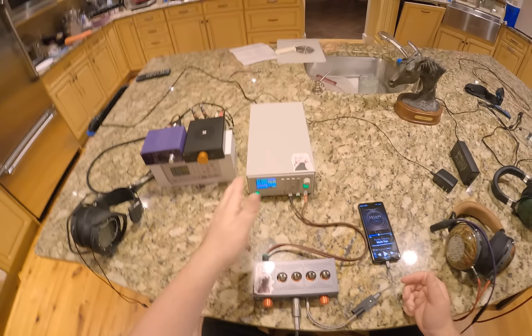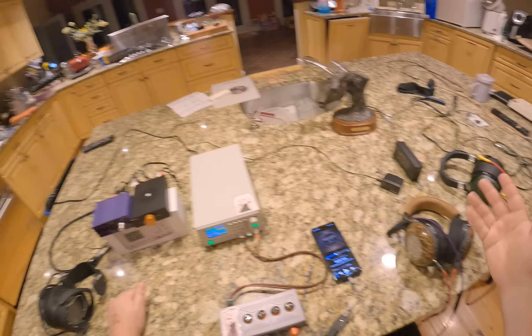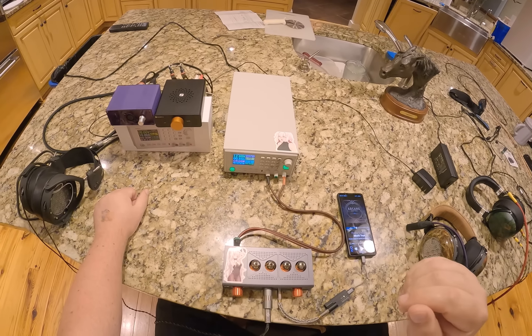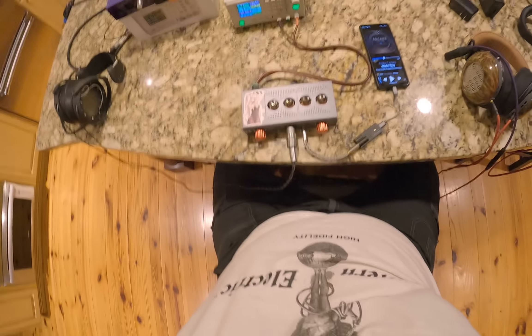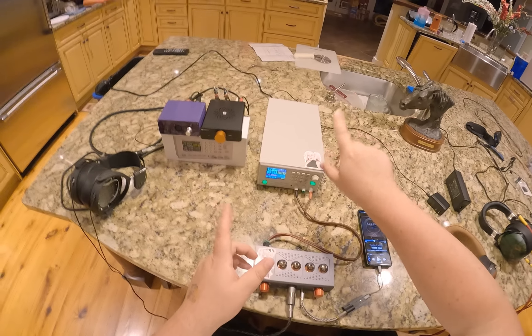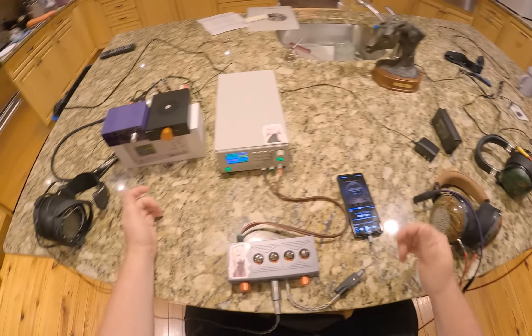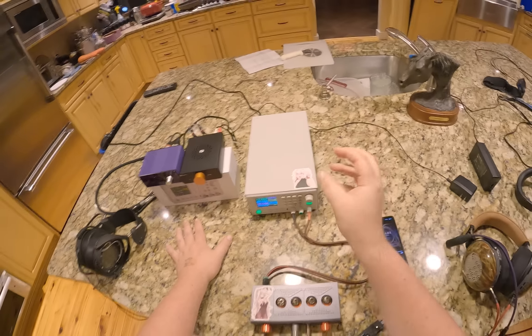The only problem as an audiophile is you probably only have one of these, and you do require DC gear — anything that runs on 110 out of the wall you're not really messing with. The biggest example was the FiiO R7 — the standalone DAP with the vertical screen and all the outputs. It said you could use AC or plug it in DC, and I used an 11-amp, 12-volt DC power supply on it and it legitimately made the headphone amplifier in that sound better, because the built-in transformer was just a cheap little thing to make the Android device run.